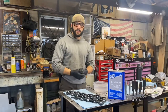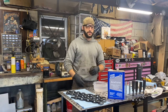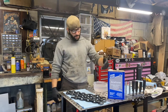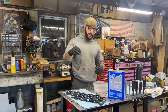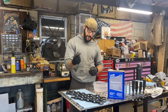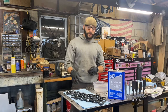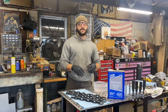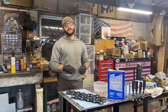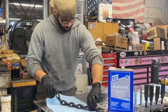We've got all the rust cleaned off of our sections of chain. One last cleaning step I like to do: I have a small bowl of acetone here. I just like to soak the chain in this — it's going to get rid of any residue, soot, or rust-removing material still on there. It gives us a nice clean steel surface to weld on. We're going to let this soak for about an hour or so.